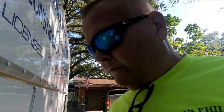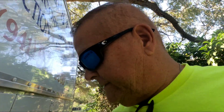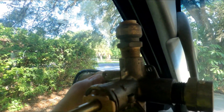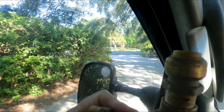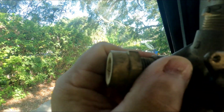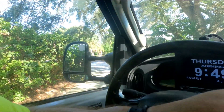Tomorrow's my birthday and I'm taking it off — gonna have a long weekend. It's my birthday, I'm gonna be 59. Jackson, 60's right around the corner. I never thought I'd get out of my 20s! The house is all CPVC, so I've got this valve and I'm just gonna use a SharkBite going up to the shower head. I've got two CPVC male adapters, brass by CPVC, and I've got a plug on the bottom — I'm just gonna cap everything off in this house.